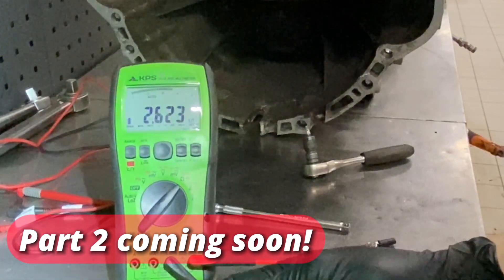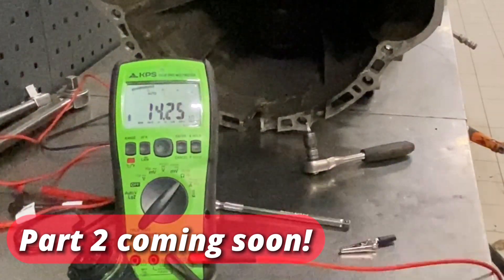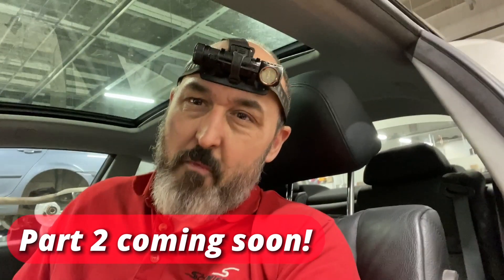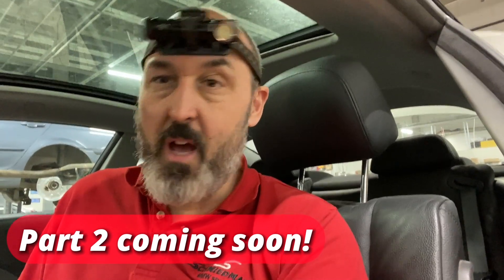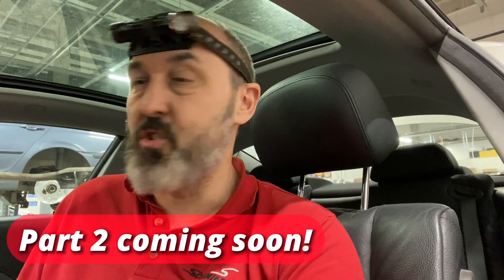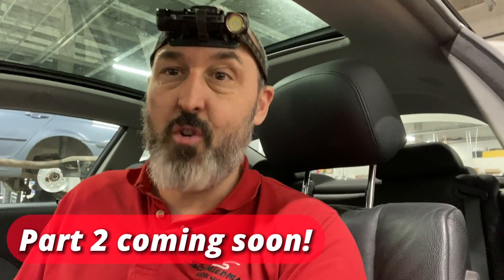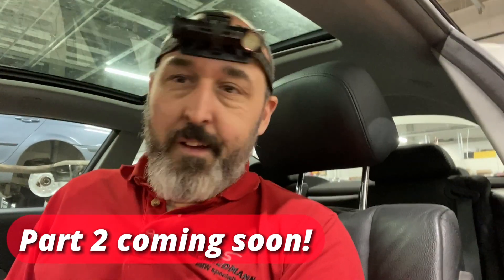And this is a classic case of what a wiggle test will do. We're just touching the wiring there and it's going absolutely haywire. So the fault is a break inside this part of the wiring. That's the sensor diagnosed - this is the old one, we're not going to do that with the new one. Here's what it looks like with voltage applied. There was also a fault code for EEPROM faulty in the CPU and the SMG control unit, but that doesn't mean anything - just old garbage technology. If you've got one of these, basically rip it out, throw it in the bin, put a clutch pedal and master cylinder in, just put a normal gearbox in. Worst garbage ever made - I've hated them for years. Every time they come in, they give me a headache. The only thing almost as bad is those Renault and Nissan robotised Magneti Marelli gearboxes.